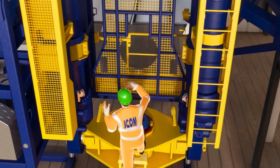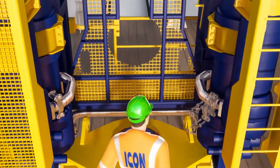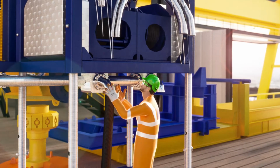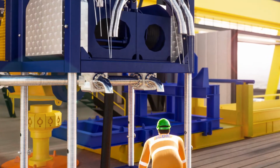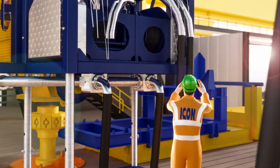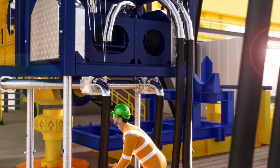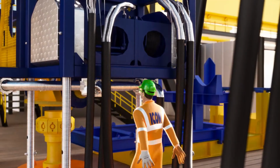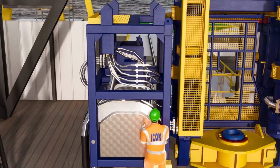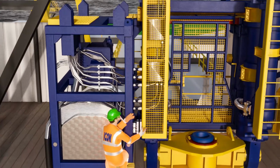2 jumper pipe spools are then installed between the CTLF and the guide frame, made up with Tech-Lock connectors, and umbilicals, which were previously installed in the derrick, are now connected to the back of the guide frame. There are 2 primary high-pressure air hoses plus hydraulic umbilicals that operate the CTLF-mounted winches, an electrical umbilical, and a CTLF hydraulic control umbilical. The CTLF control umbilical passes straight through the guide frame and is made up to the CTLF with a stab plate connection.